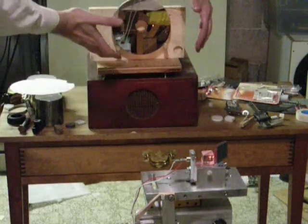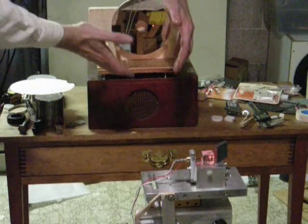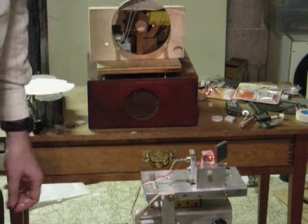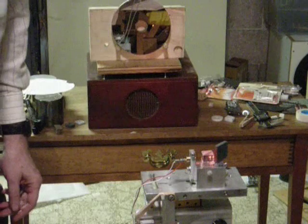There is a large beam expanding onto the mirror, and that beam is shining back towards the interferometer. We can use that to help us find the radius of curvature of the mirror where we want to set up the interferometer.